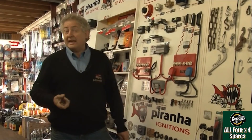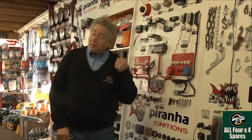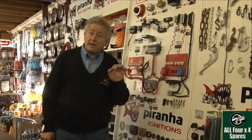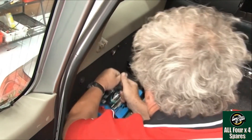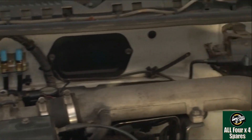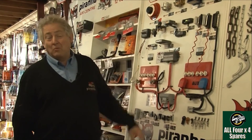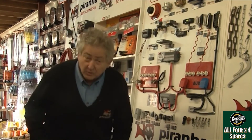The next thing of course is an infinite choice of batteries. You don't have much choice over what battery the car comes with initially, but once that battery is worn out the choice is up to you. With smart systems we can run any type of chemistry or technology. Different chemistry batteries require different amounts of voltage to charge correctly — they have different charging regimes. With these systems we can actually use dissimilar batteries with very specific charging regimes and still get them to charge properly, which is very important. And of course, very importantly: Australian made, Australian tested, and five-year or more warranties on many of these products are very important because we know this is going to be reliable.